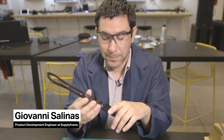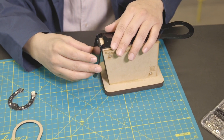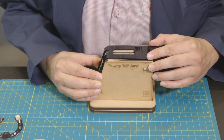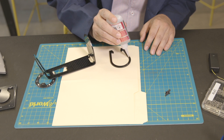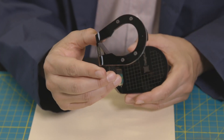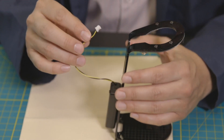After laser cutting the acrylic, we're going to use the bender to give it its shape. The acrylic is already soft — time to bend the first shape. An important thing is not to skew it, otherwise when it bends it looks weird. We're going to add the base to the lamp. Securing a PCB to the product is one of the most important processes. This is an easy project, so that's why I'm using tape — normally we would secure the batteries in a different way. Battery pack is in place.